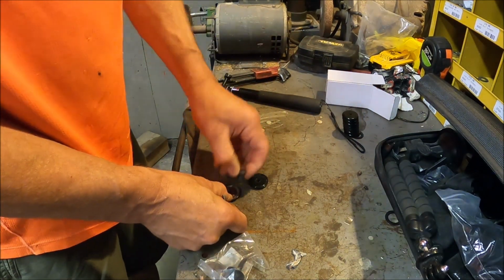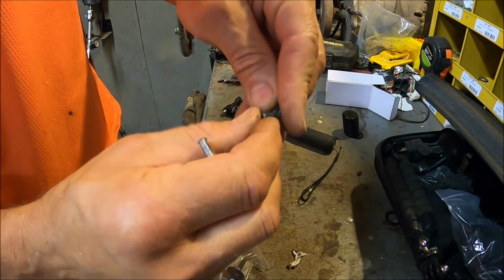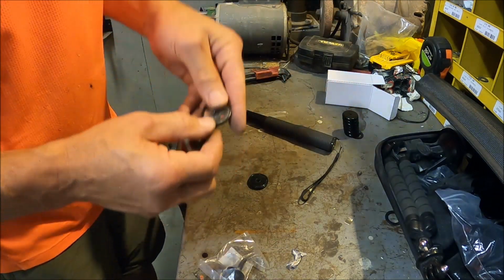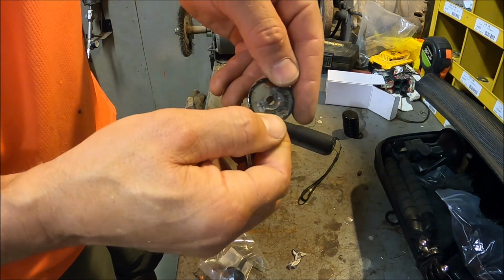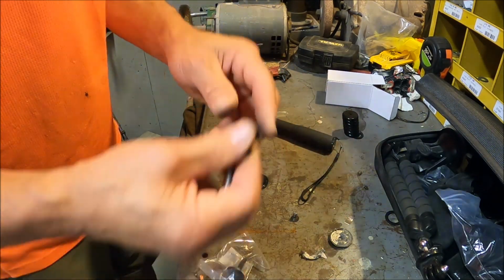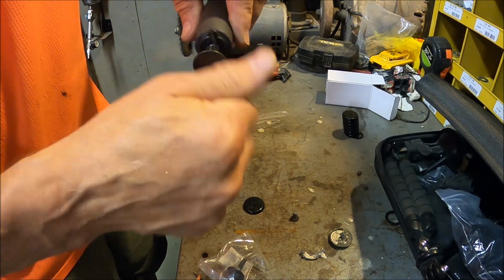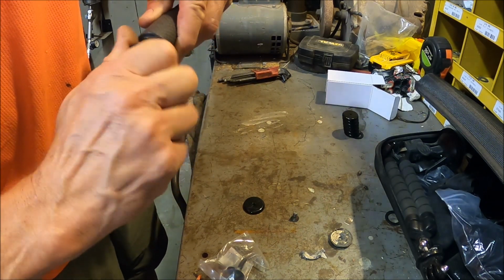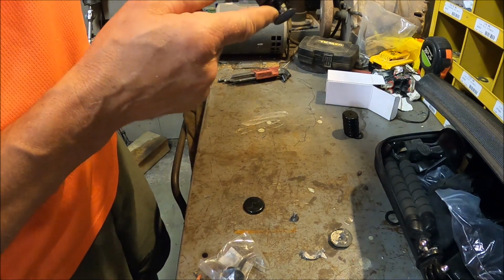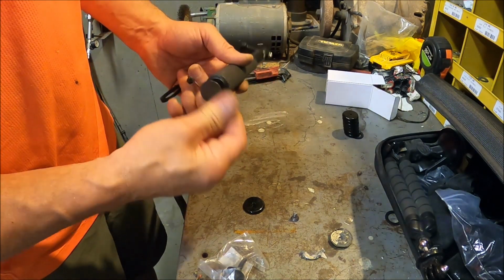Well, everything was going swimmingly, but this bolt's just so big, being a quarter 20 thread on the bottom of the selfie stick. That's what you end up with, a quarter 20 taper, and that's a big countersink for a magnet. So it's hardened, and you can see it's just chipping away at it, and then it finally cracked. So I've got something here from the store, and I think it'll work. It's the only thing I can find that's flat. I got an option. I could grind off those little square landings, like on a carriage bolt. At least that'll lay more flat when I get the magnet in there.